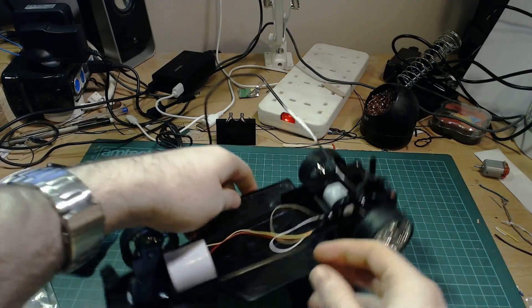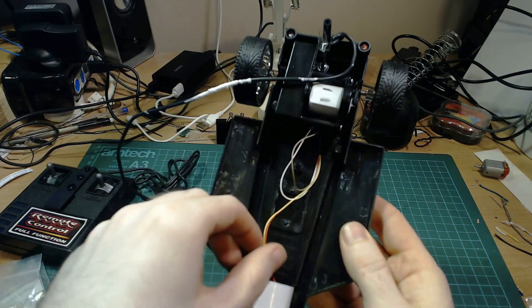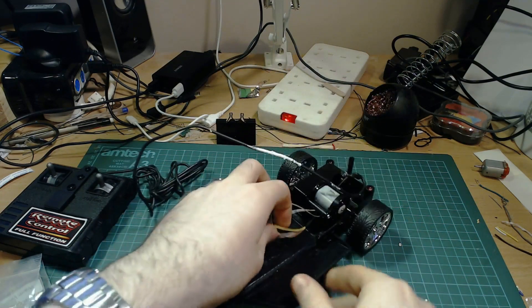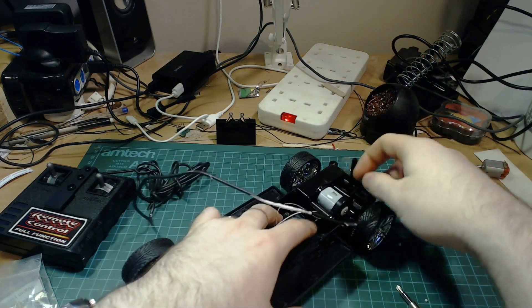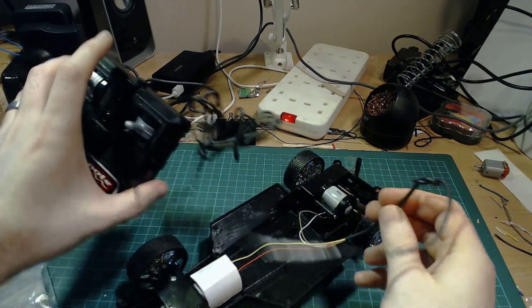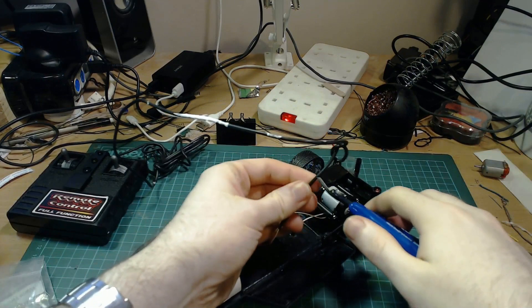Now we want to wire it up to the car. I mentioned earlier that the wired remote was an advantage — that's because there's nothing in the remote but four wires going to the two different motors, and these are the wires that we want to connect with. A normal wireless RC car will more than likely have the same two motors that you'll need to connect with, but to make room for the ESP8266 you'll probably need to remove all the other circuitry. If you are using a wireless car you might have the option of reusing the battery slot that came with the car, so keep that in mind.